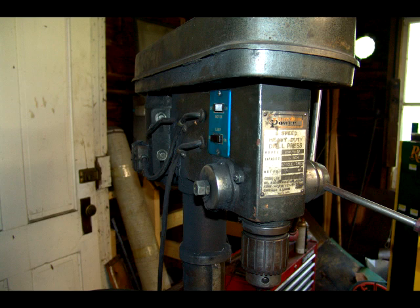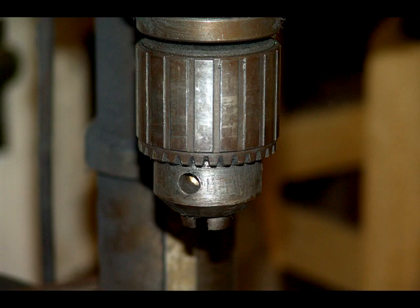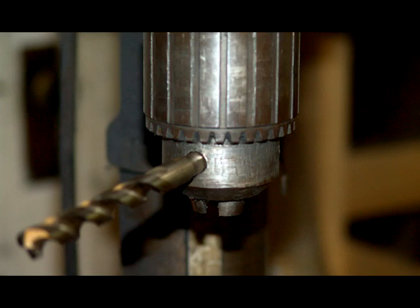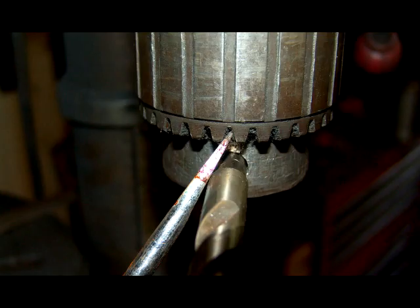This is my old drill press that I inherited from a family member. As with many old drill presses, we're missing the chuck key. If you're like me, the most commonly lost tool of the drill press is the chuck key. You can chase around the hardware store in vain looking for the right chuck key, or you can insert a drill bit into the hole and then use a screwdriver levering the cam gear.